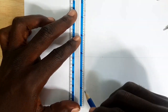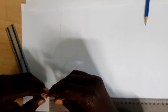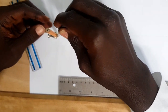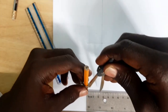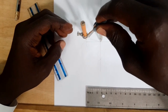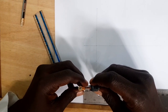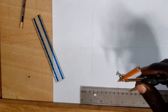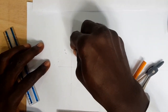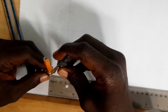After that, we will be getting a center here. To get the center, we will take the distance of 30mm from end to end on our line, finding the midpoint of it. Let's draw a mark there — that is our midpoint. Let's check our circle; it's a little bigger, so we have to take the measurement again. Let's take the distance 30mm again.